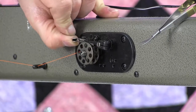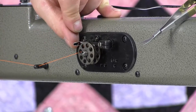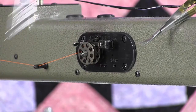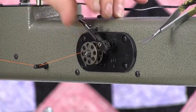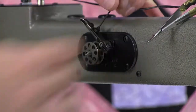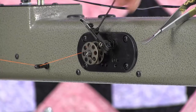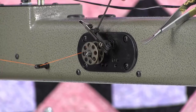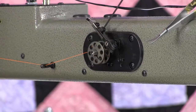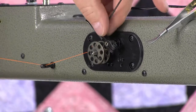That's pretty close to where we need to be. There's also a smaller adjustment: a nut you can loosen, and then you can screw this in and out with a 1/16th inch allen wrench. It pushes this little flat spring out a bit further to give you a more minute adjustment if necessary.